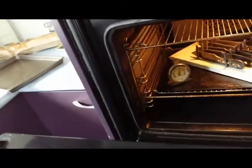As you can see here, I also keep a thermometer, so that obviously lets me know what that's doing. And I've done a lot of tests on this oven, so I can pretty much get the results I want, but the problem is I'm around. So if I aim for a 59, I will get between 58.5 and 59.5 using this oven. So that's why I've got into the habit now, I do a 200 cycle for 2 hours. That's my first temper cycle.